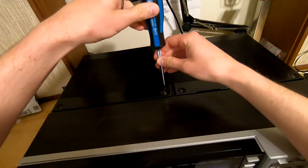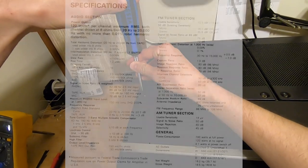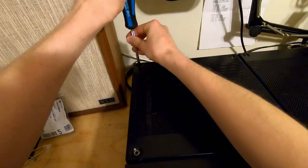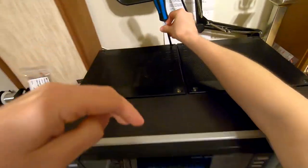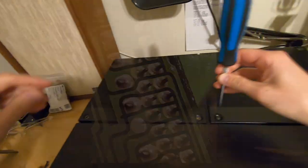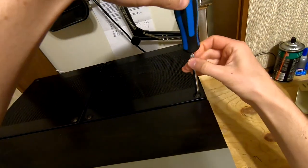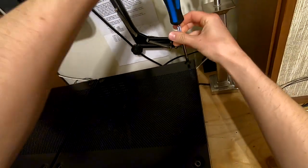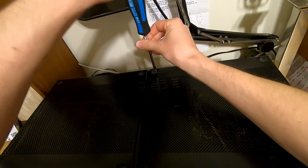I forgot to mention — this thing is also rated at 120 watts per channel into 8 ohms, so that's quite a few. I've had this apart in the past actually; I took it apart when I first got it years ago because the vacuum fluorescent displays would go in and out if you pushed down on the receiver. What that ended up being was cold solder joints on the circuit board where the display attaches, because these displays run pretty hot as most vacuum fluorescents do, and the solder wasn't up to the task after 35 years. Now this thing is 40 years old and it's impressive it works as well as it does given the complexity.